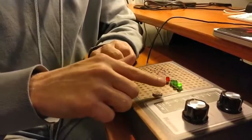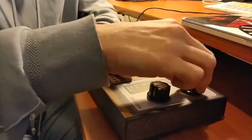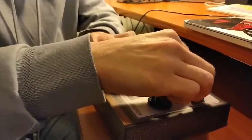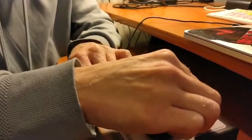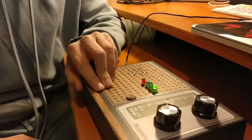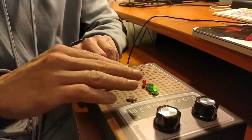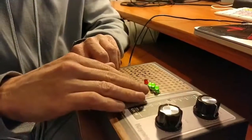And in combination with the different potentiometers, it allows for various different low frequency oscillator tones. We also have LEDs attached to the circuit. As you can see when playing with the LDR — when changing the resistance of the LDR — the LEDs change. And this was done by coding the Arduino using the IF and ELSE IF commands.